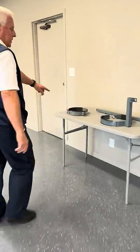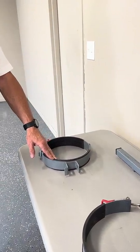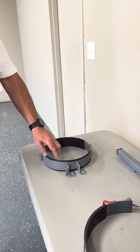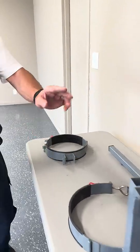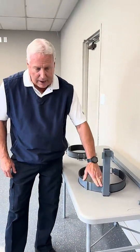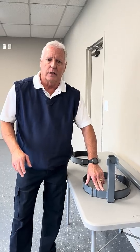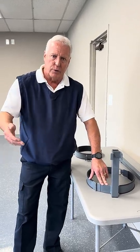Here we have the ECL-8, the standard bracket that shows up on your ECL-8 if you don't specify anything different. Single bolt. Here we have a leverage bracket — single bolt but with a shaft. This is used to handle shorter tanks so that you can create the leverage you need to articulate from vertical back to horizontal. Let me show you what I mean.